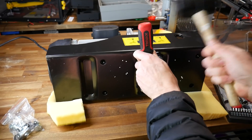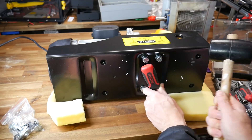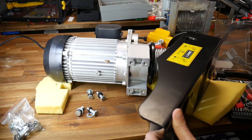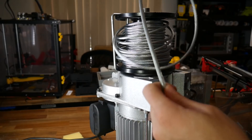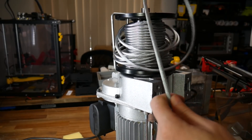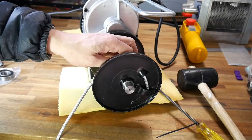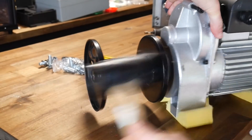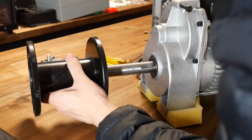When I started the teardown I was fortunate to find it was a little bit easier than I was expecting. The large bracket frame on the underside is for bolting to a garage, so I didn't need it and removed it first. The automatic shutoff and the stainless steel cord were also easy to unbolt and unravel. There was simple geometry clamping the end of the cord, so with a few well-timed rubber mallet hits I got the spool off and the output shaft was finally revealed.